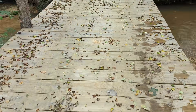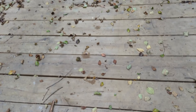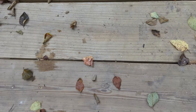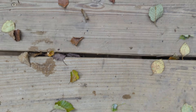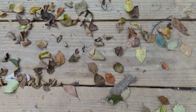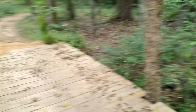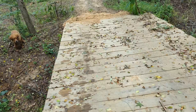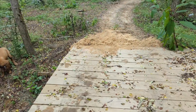One thing I did differently here: on smaller bridges I built before, I used to put gaps between the boards. As you can see, this bridge has only been eight or nine months old and the sun has already drawn the wood up and made cracks. So on this one I flushed the boards right up against each other, knowing they would shrink apart over time.